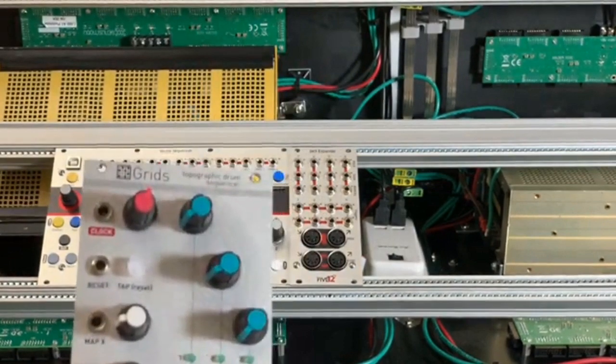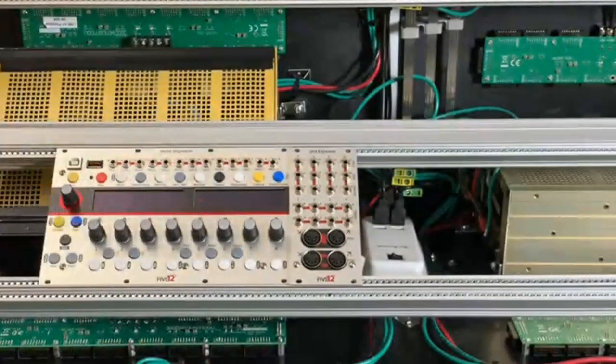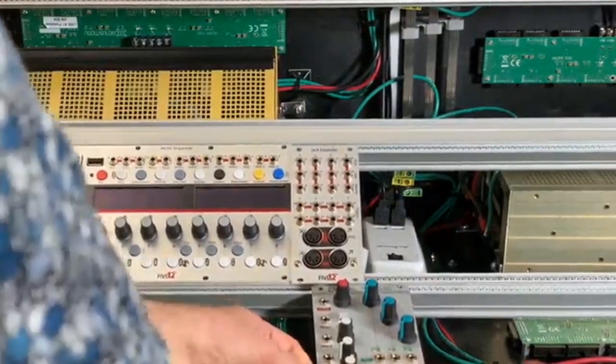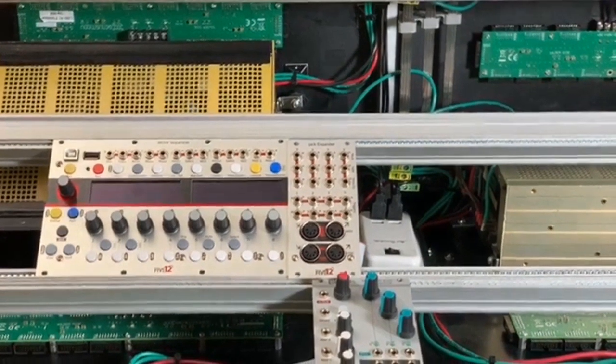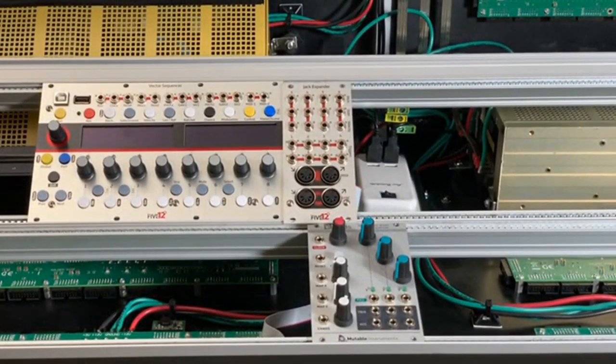Yeah. One nice trick that I remember talking to someone about in some kind of Skype session ages ago was that you could run an AND logic gate, or make one in a VCA, to make sure it absolutely doesn't play a note at a certain point of the bar if you needed it to. If you had a spare CV sequencer, the solution we had was, because he said, I don't want any beats in the last half of the bar. Effectively, within the last eighth note, I don't want any bursts or flurries of notes. We came up with a solution: if you have a spare CV sequencer, turn up every step other than that last one, use that as the CV depth control of a VCA, and then grids as the input. So you know that CV is going to pull the VCA off, and therefore none of grid's pattern will actually pass through on that last beat. You could do the same by putting both signals into an AND logic gate as well.